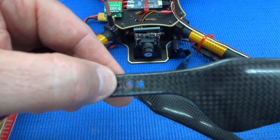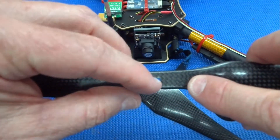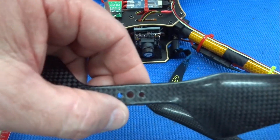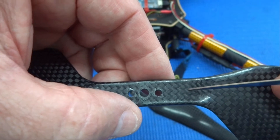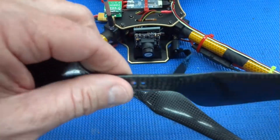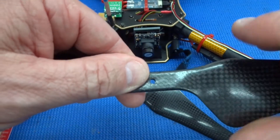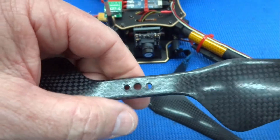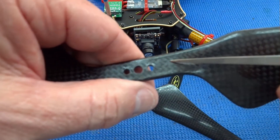The root is going to get all the stress in a couple of different ways. First, longitudinal stress — when spinning, centrifugal force pulls on the mounting screw, trying to pull the prop out. I wanted to get the hole far enough back along the root so there's enough material to support it. Secondly, torsional stress — the prop generates lift and has twist, so the back end tries to lift. Being held in the adapter, it can't, so it raises the craft instead.